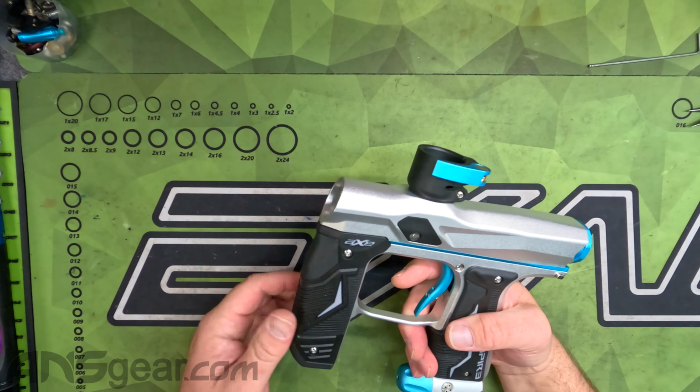Now on the other end of this is this. So you've got your spring on this side, your plate on this side, and then you've got this adjustment screw. When you turn this adjustment screw on the outside here, you're pushing the screw into the plate and compressing this spring right here. You're pushing this way. Or if you back this screw out, you're relaxing this spring.